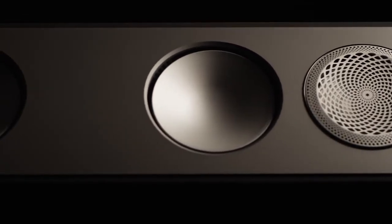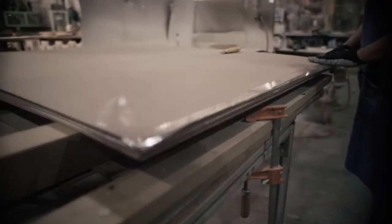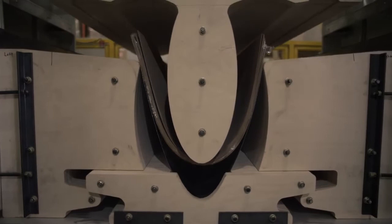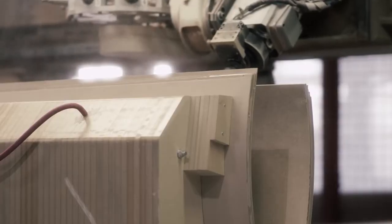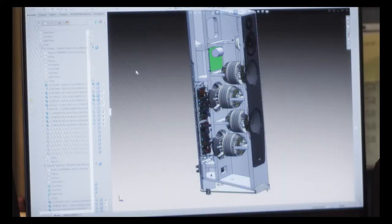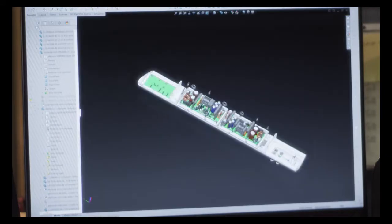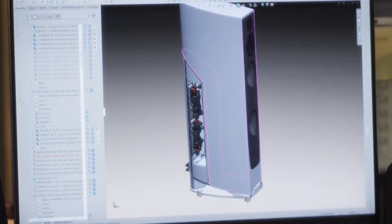One of the things we had to work with in this design is having a big speaker but not necessarily making it appear as though it's a big speaker. We decided to go with curved cabinets, which are based on elliptical geometry. We use these beautifully curved cabinets that sort of disappear as you turn them away. The shell of the cabinet is built of seven pressed layers, which creates a very strong composite material. It is impossible to make those mating surfaces by hand — we had to use five-axis CNC machining to cut the parts that need to be combined into a single cabinet. We had four bass drivers and two big amplifiers, plus electronic components and controls, so it was very challenging to fit all the components into curved cabinets.